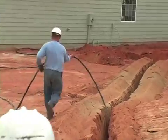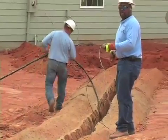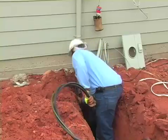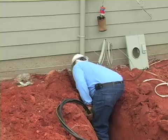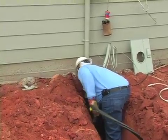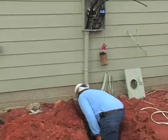The wire is placed in the ditch. Sometimes our crews are under contract to bury the phone cable. Thomas is ready to connect the house. He pushes the wire through the conduit installed by the electrician. There are three wires for secondary service from the transformer to the meter — two hot conductors and a neutral — providing both 120 and 240 volts inside.